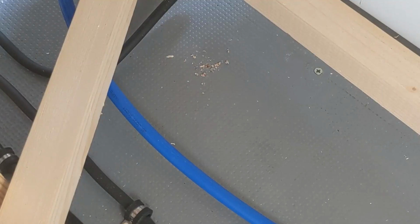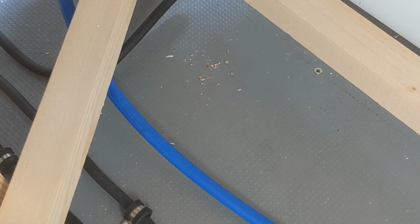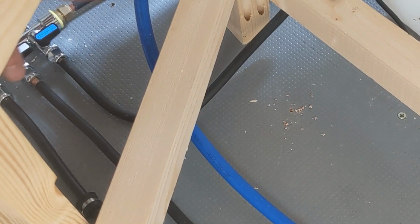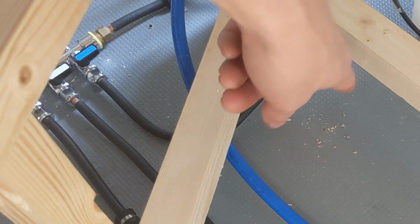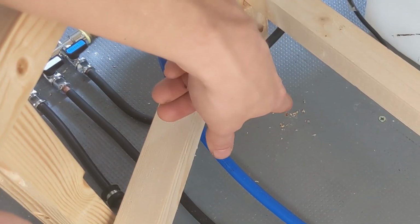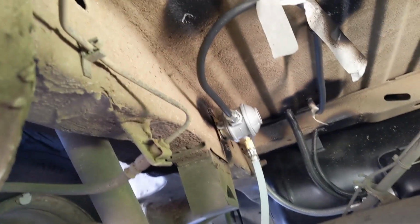Our third and final dropout vent is going to go about here, where we've just started the holes to mark it, which is close to our gas distribution unit over here, so if any of these connections over here leak, they should drop out from there, because LPG is heavier than air, and so it will sink down through the floor.